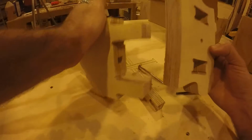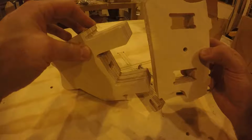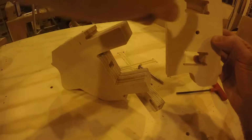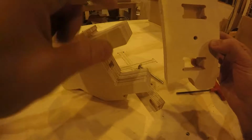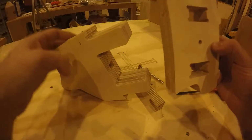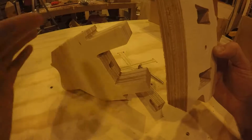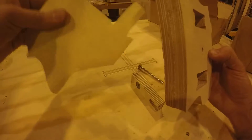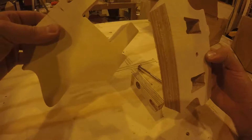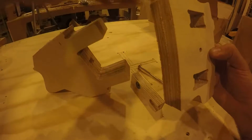And the reason why I did that is you don't have control over the plywood thickness, but what you do have control over with a CNC machine is every surface that the machine mills. So the machine mills this profile here, and the machine also mills this opening, which is why we're able to get a nice tight fit this way, but we've got to leave a little extra room this way. And this is so I can just grab any 3/4 sheet of plywood, or if I've got scrap or some blank space on another job, I can tuck in one of these legs and get it done. So it really makes it efficient. And if I want to replace a part for somebody, I can just make them a replacement part and it'll definitely fit in their piece of furniture.